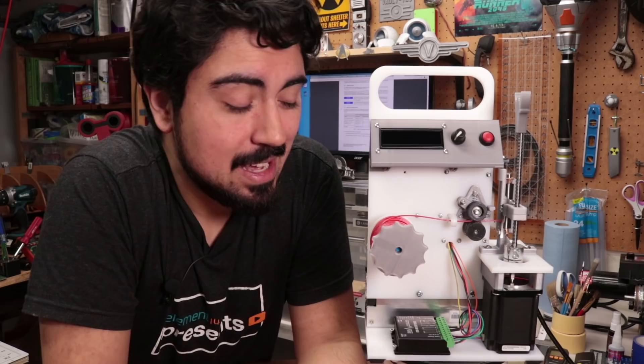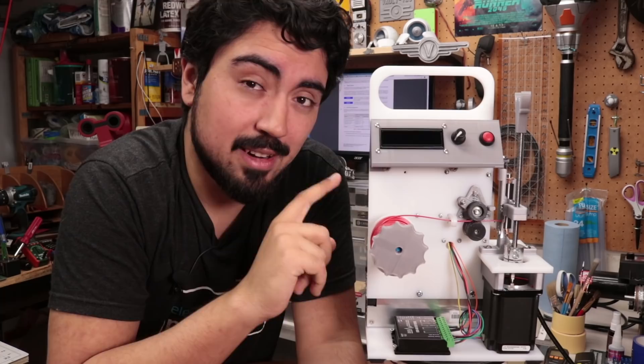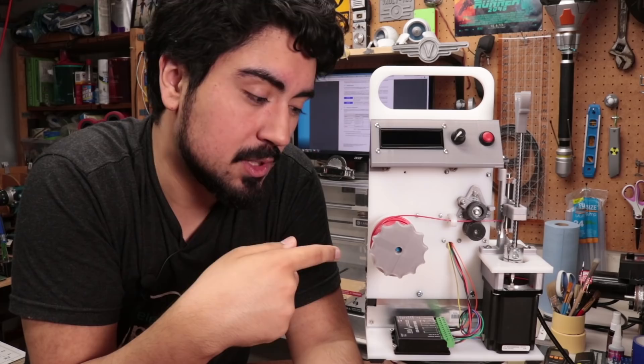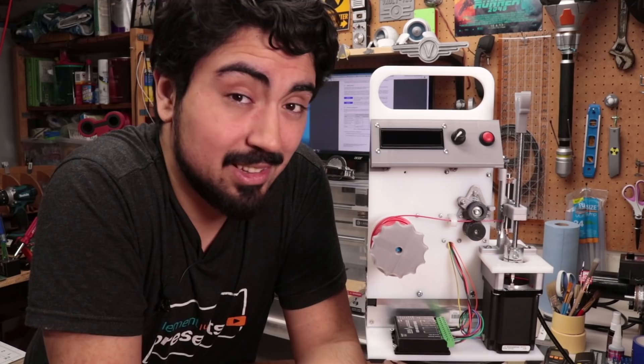The insulation cutting still needs a little work, but it's darn near perfect for my needs. We set out to build a machine that could automatically cut and strip wires, and I think this does the trick. This is certainly just a working prototype, but it does what I want it to do. One big improvement would be adding an NFC or RFID reader so I could tag spools and have the machine track how much wire has been cut from each spool. Also, the accuracy of the feed mechanism needs to be improved — right now these are accurate to about within a millimeter, which is good enough for hobby work, but I think I can do better. What do you think I should add to make this better? Let us know at element14.com/presents. Thanks for watching.